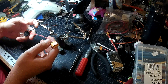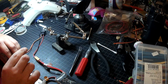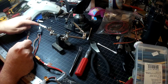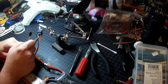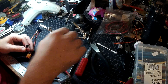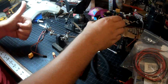This is our current limiter. We can plug this into our battery, and between the red wire and the black wire we can pull 2.5 amps before the bulb comes on. Between the yellow wire and the brown wire we can pull 0.5 amps before the light comes on. If the light does come on, it will sink our current so we'll be safe. This way I don't fry my whole $60 board when I start reflashing the built-in ESCs.